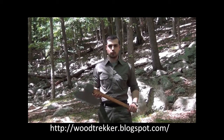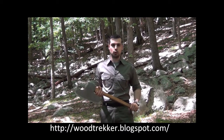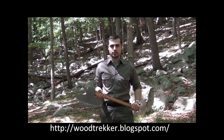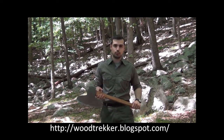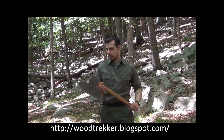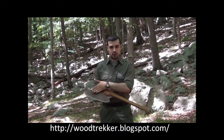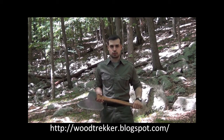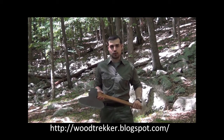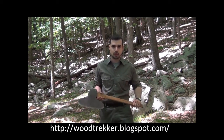One of the axes you're likely to encounter is the broad axe, sometimes also referred to as a hewing axe. As the name implies, the axe is used for hewing wood, turning a round log into a beam or a board. One characteristic of these axes is that they have a fairly heavy head on a fairly short handle. That's because this axe is used with short strokes to take off large sections of wood and it's not swung over the shoulder like some other axes.